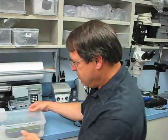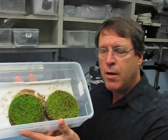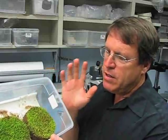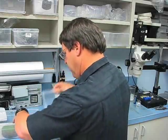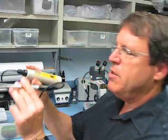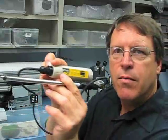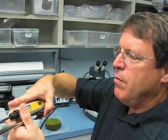In addition to using the EC meter in the field, you can also use the meter in your office if you want to take a look at some samples. Right here we've got a couple of samples from a rapid blight infected green. We've been talking a lot about rapid blight because it's a salinity and sodium affected disease. So let's take a look at how we might use the EC meter in the lab. The EC meter we're using is a Spectrum Technologies FieldScout EC meter, and this seems to be the easiest to use and is quite reliable in the field.